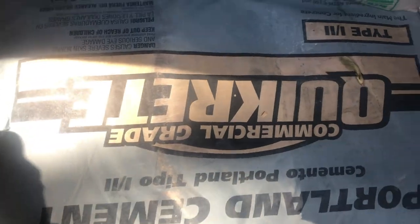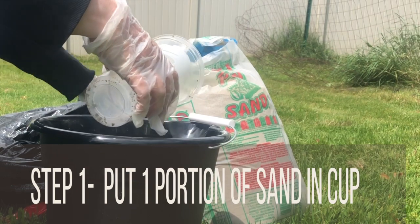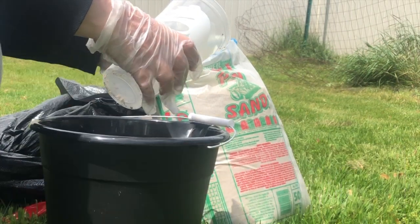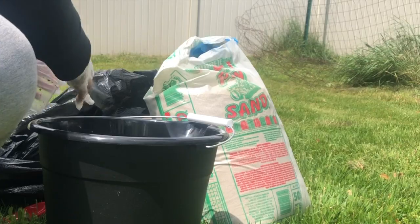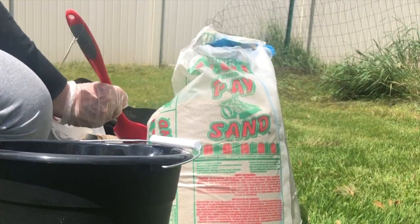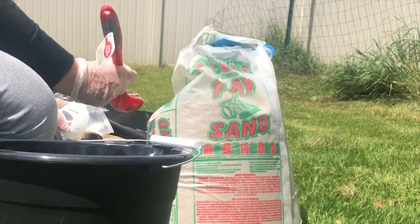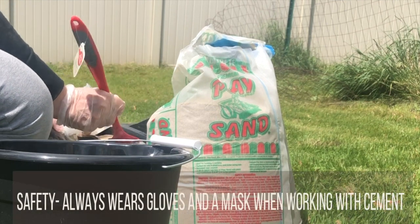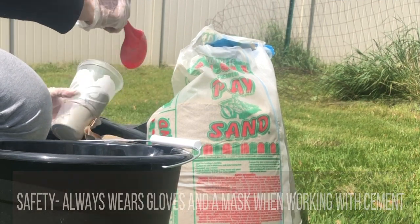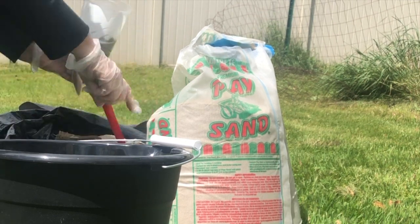You also want to pick up some sand, so you can mix a one-to-one ratio with the cement. I filled the cup up three-quarters with sand and put that in the bucket. Then I moved on to the Portland cement, using a plastic spoon and filling the cup about three-quarters of the way. When using cement, you should always wear gloves and a mask, because you don't want to breathe it in — it could be really bad for your lungs, and it does dry out your hands too.